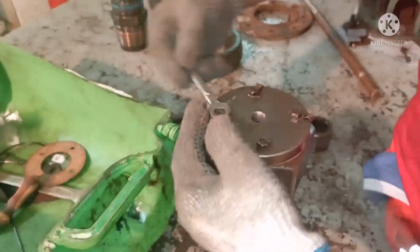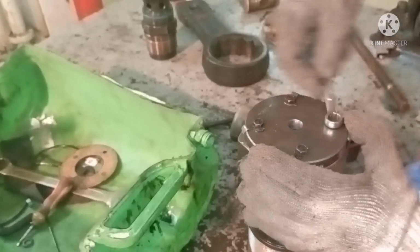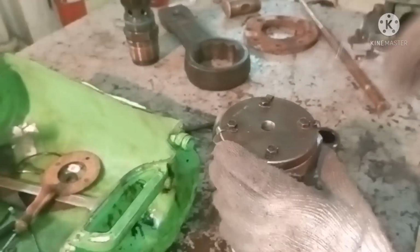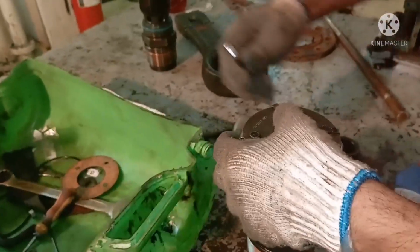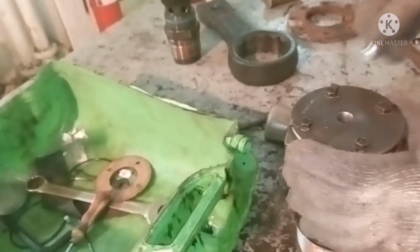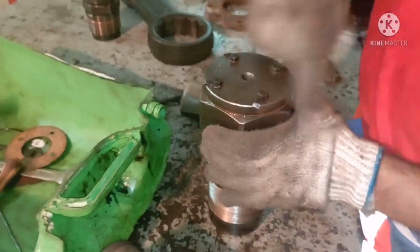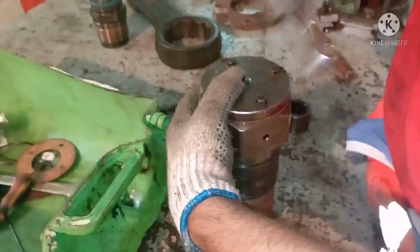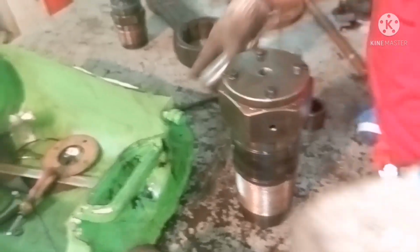Tighten all the four bolts evenly. Even tightening should be done, and once the tightening is done, you can lock the puncture valve bolt locking plates. Just fold it, that's all. That is what you call locking a lock plate. Just hit it, and you have to ensure the plate is properly held along with the body. So okay, we are done with the top portion of the puncture valve overall. So next we will be going for the other side. Tightening is done. Okay, finish.